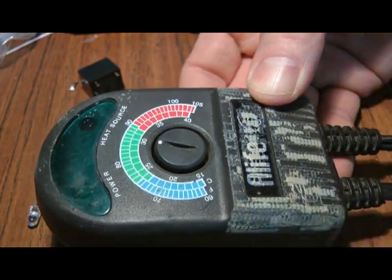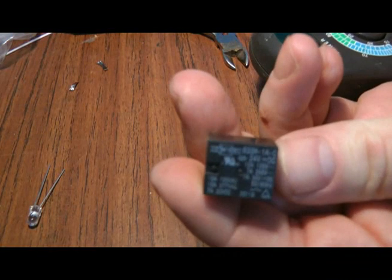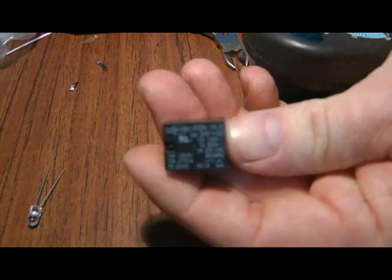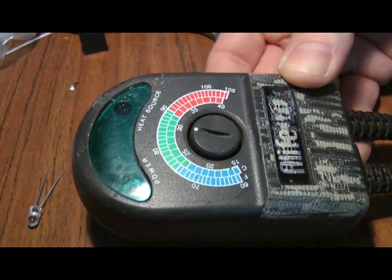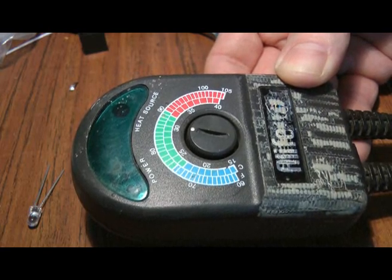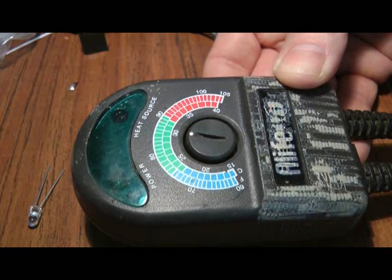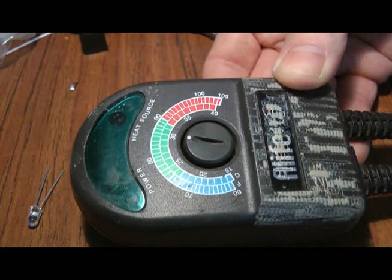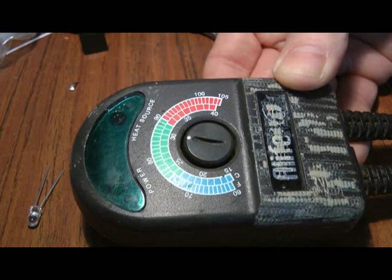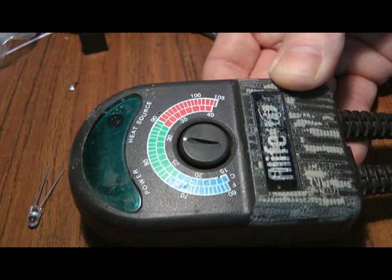You've got a new Alife controller that will last probably another two years on a good relay. I know these are kind of expensive and I have them go out from time to time because they're a fairly high duty cycle. I've always wanted to convert this to a solid state relay. This is a classical relay — it basically has little arms and levers in it, basically electromagnetically controlled. That's why they wear out; they're mechanical. I've wanted to convert this to a solid state design because I'm an engineer. If I ever do, I'll make a video. If you put a solid state relay in there, you'll never have to change it again, which is the point. I'll put app notes and also supplier and relay numbers in the notes underneath the video on YouTube.